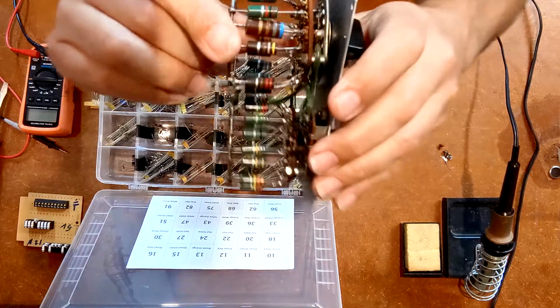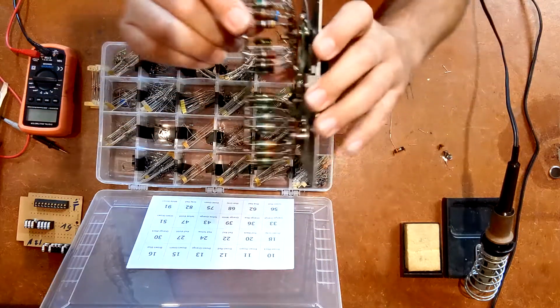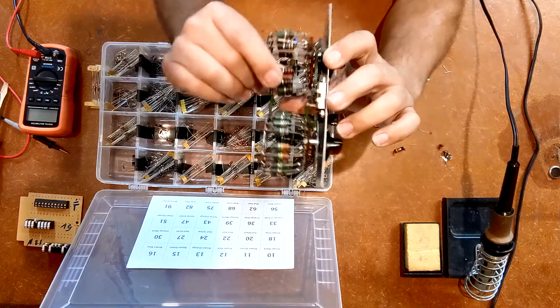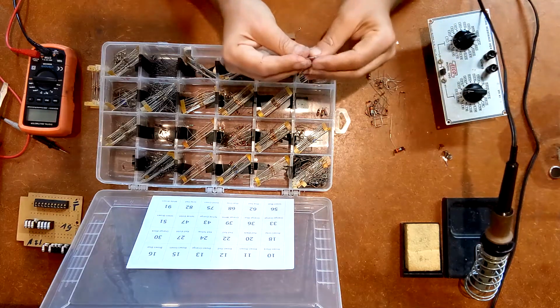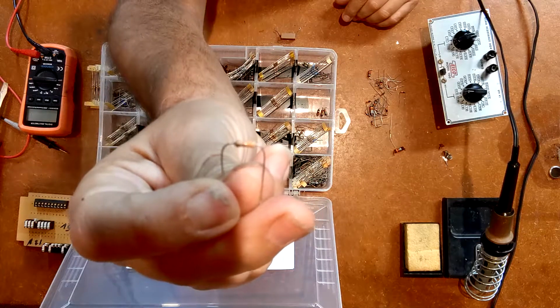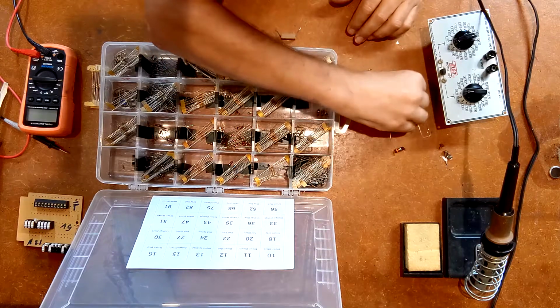And most of these look to me to probably be, well, you know what, there's one much larger one here. Hopefully you can see that one's bigger than the ones around it. So that could be a 2 watt resistor. The others are probably 1 watt, I would guess. Most of the resistors I have here, kind of give you a comparison. This is generally about a 1/4 watt resistor. And there's something smaller that's an 1/8 watt that exists.